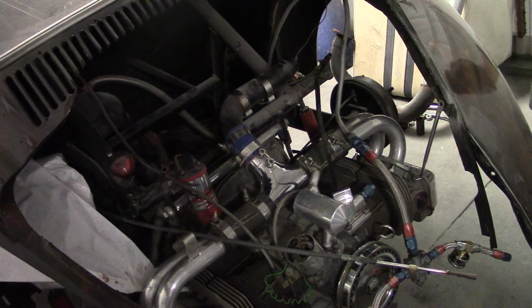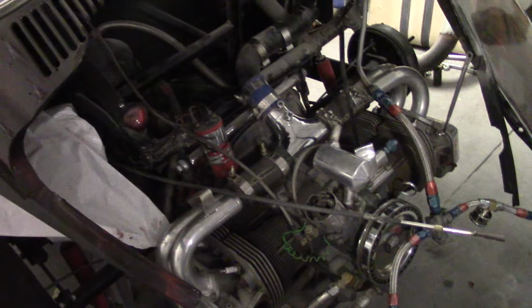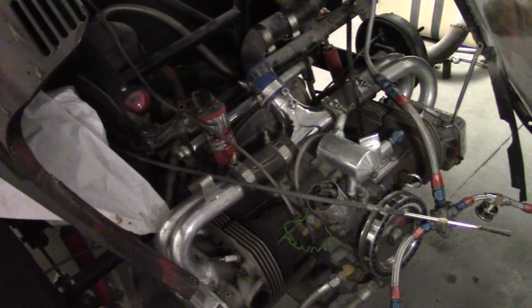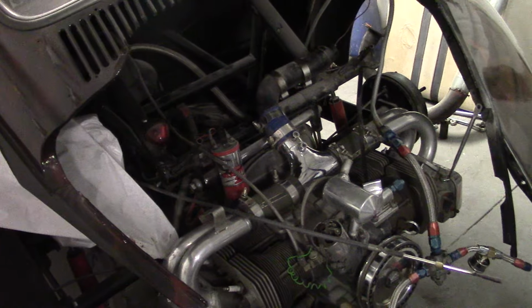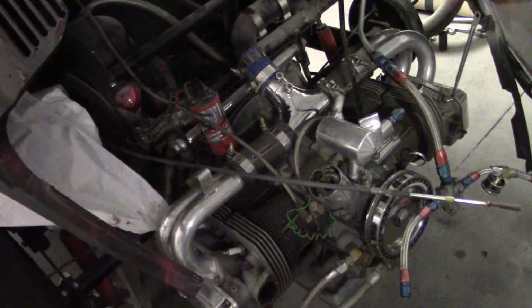We're going to go a little smaller on the turbo so it's more compact, but we're going to go ball bearing, so it should make really good power, spool up quick, and be easy to drive on the street. So we're going to do a set of those manifolds right off the top of here, and then another set of manifolds off the top of that to build our intake manifold. So we'll get into the intake system after we get the exhaust.